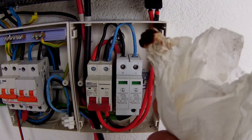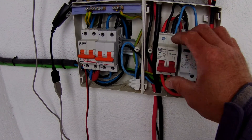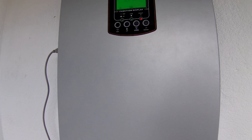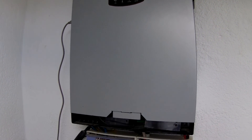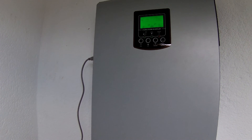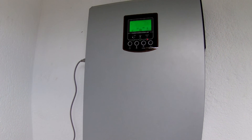This is all the crap that came out the end of it - it's definitely rust and corrosion in there. Somehow damp or condensation managed to get in there and basically killed the bearing. Final test then - solar panels back on, connected. Even though it worked out of the machine, once it's back in the machine we've got the same old fault again. It's charging and doing a different beeping, but it's still a fan fault - error zero one. So if the fan is too far gone, which I think that one probably is, that hack doesn't work.